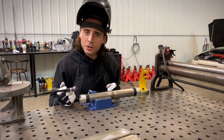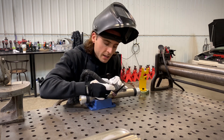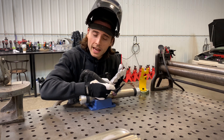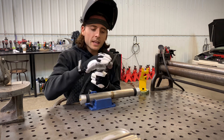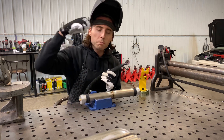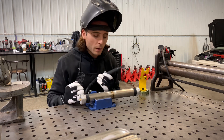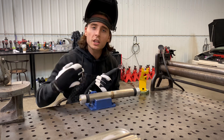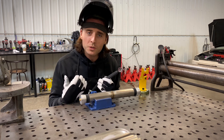The second way is the slow and pretty way. You might only do 12 or 15 dips and you'll have more start and stops. It takes longer, but if you do shorter runs, the nozzle can keep your current short welds completely covered until they fully cool down. What that means is you can keep the entire weld all the way around a gold or straw color, which customers like to see — and I think that looks really good as well.